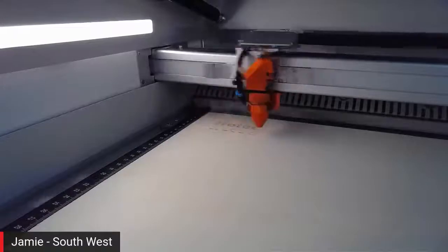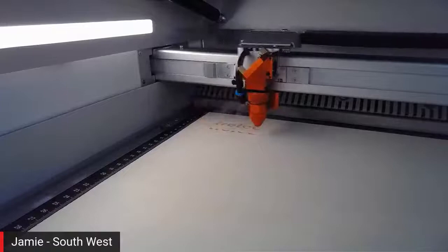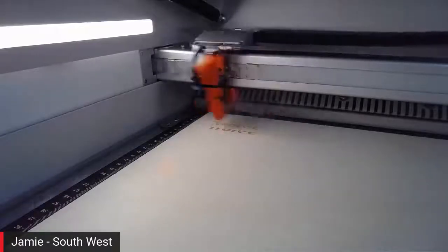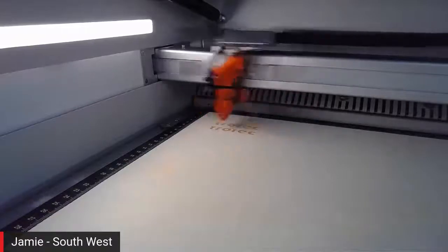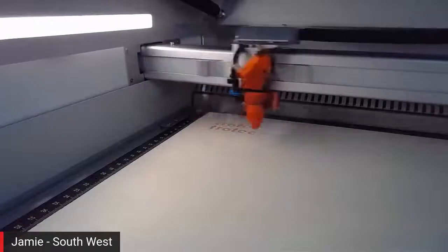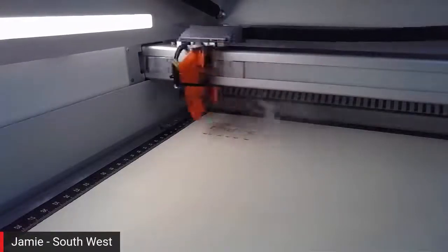Okay, so this one we expect to be a bit darker. Yes, this one's dropped to 4mm out of focus. So very slightly harder to see on that camera, but there is a slight discoloration. So we're running at 4mm, and then we'll see it drop down to 10mm. So once this row's finished, we'll just see the table drop by 6mm. There we go, and then we'll again straight off again. So we're now at 10mm out of focus.